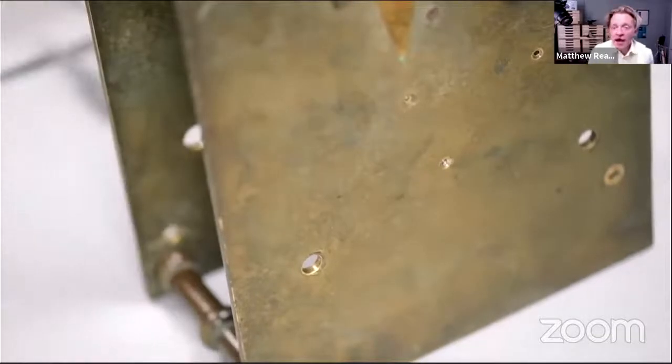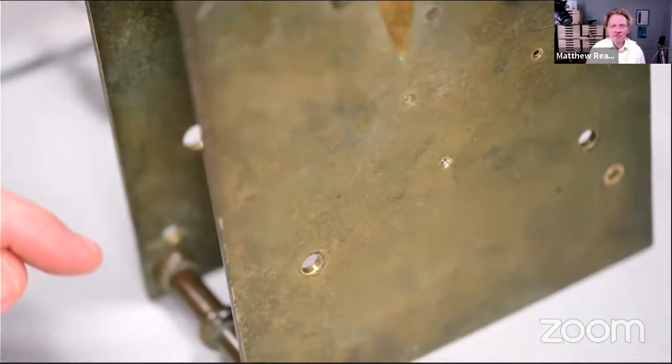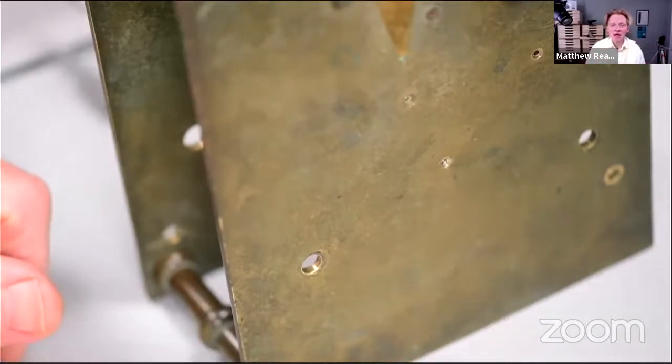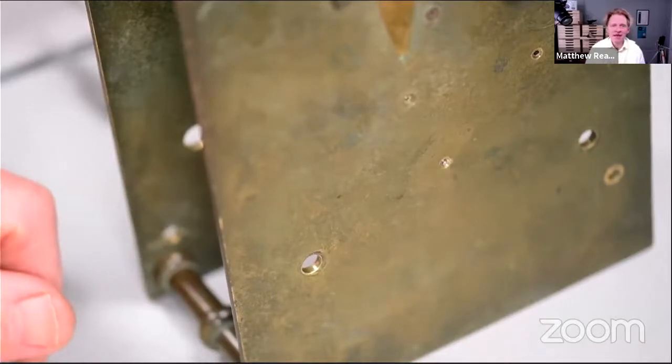So there we are. What did we learn? As always with the pivoting, get the hole as deep as you reasonably can. I think putting that bush round is really useful, it prevents the arbor from splitting. Maybe my pivot should have been a bit more parallel. If I get time during the week, I'll redo it, but I imagine now with that glue on, it's going to take a bit of heat to get it out, so may well leave it there.